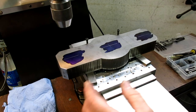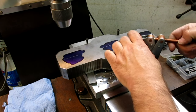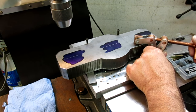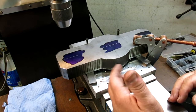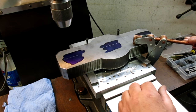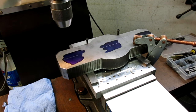And then we'll use cam twists here to hold this down. And we can add some mini pallet clamps too, but we're just drilling through this way, okay? So we're not pushing sideways with an end mill, so the forces are kind of low in trying to shift it sideways. So let's get another one here.